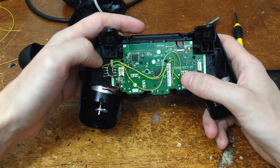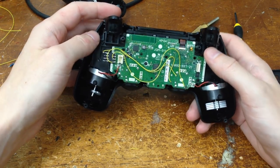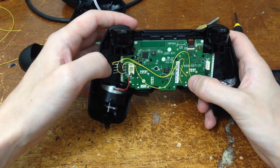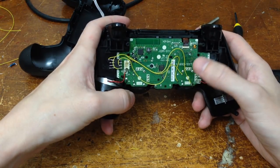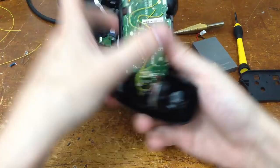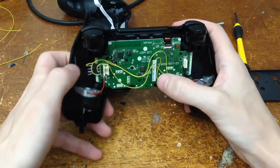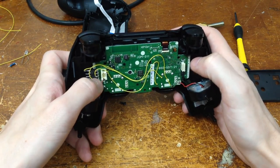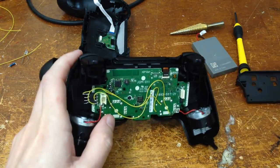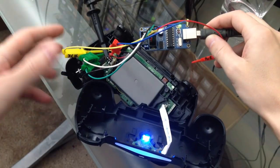I have to use the analog-to-digital converter built into the microcontroller. I do an ADC read and compare the voltage to a known amount to determine whether the button is being pressed. That button voltage sensing is necessary for the microchip to detect when I'm trying to turn the feature on and off. The other wires are ground and power - plus voltage and ground are enough to power the microcontroller. That third pin both performs the automatic button pressing and, between presses, senses whether I'm pressing it myself.